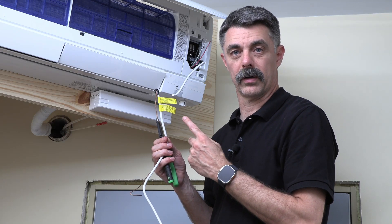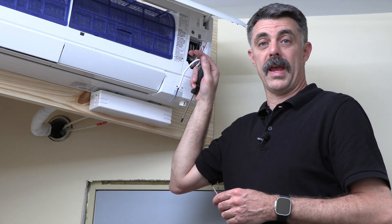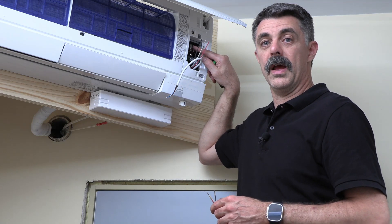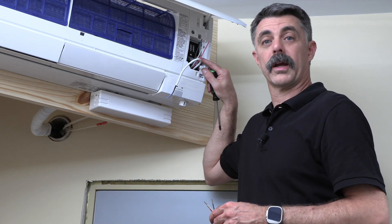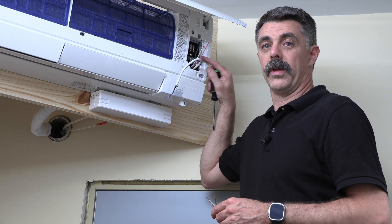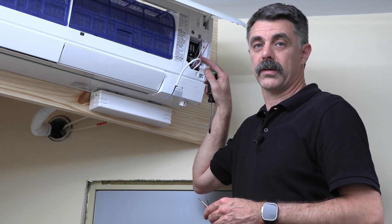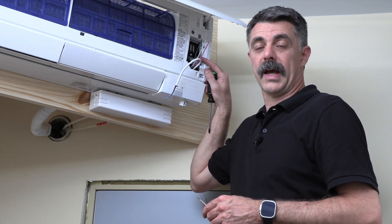Hold on to the end of this cable for just a minute. The labels on here tell you what each conductor does. Most mini-split systems use a three-wire interconnection between the indoor and the outdoor unit. We need to get power in one of those and we're going to hook up the safety switch so that if this pump ever stops or overflows, it shuts the unit and the system down. To do that, we need to put some pigtails under the lugs inside the unit and then make wire nut connections where multiple conductors need to be connected. I consulted the manufacturer's recommendations for connecting a condensate pump to their units — this is always the best path as they know their units best. In the instructions, there is a universal recommendation for connections. If you choose to go that route, make sure all the connections into the thermistor are done very well, because thermistors are a resistance device and if you make a high-resistance connection, the system may not operate exactly like it's supposed to.